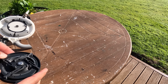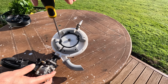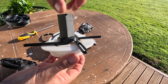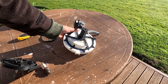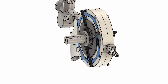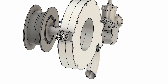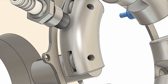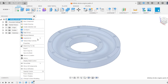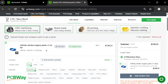Another improvement I made is I realized I could put the ellipse shape on the inside instead of the outside of the cylinder, so it takes up less room. I can also move the ellipse around to change port timing and change the shapes, and I could probably get away with 3D printing this part as it doesn't really see any heat. This is one of my final concept models — no air cooling yet, I just want to try and get it to run first. Since there's very little oscillation in this design, it should be able to do a lot of RPM, which gives the pistons a lot of centrifugal force pushing on the sidewalls, so I'm going to put some little rollers on the outsides. Now I'm drawing it up in an easier way to machine and sending it off to check it on the PCBway website to see how much it costs.